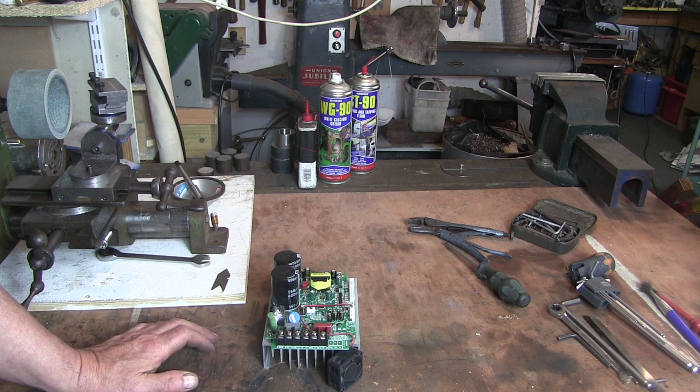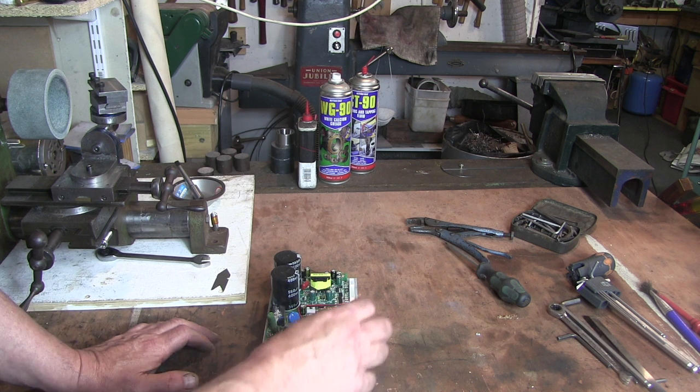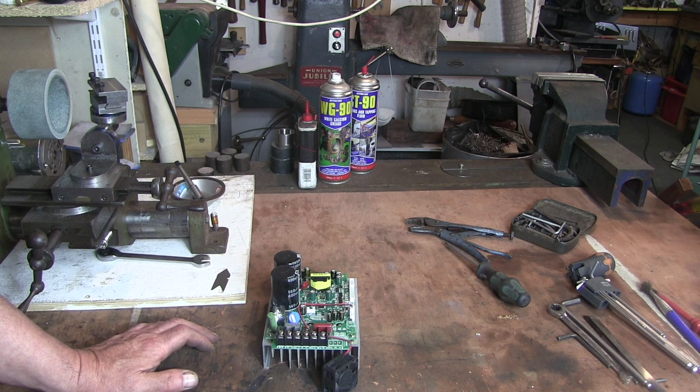But I am going to do something else in the meantime, which I might film, I might not. But learn from my mistakes. Don't be impatient. Don't kick the arse out of it, because you will kill your VFD.